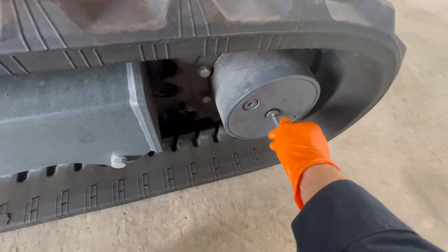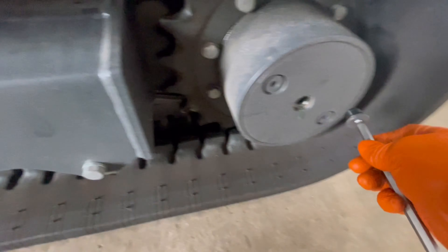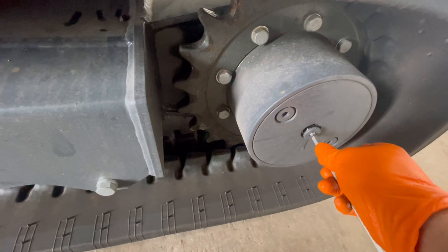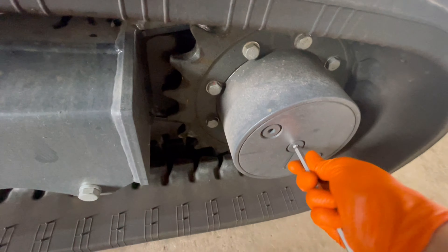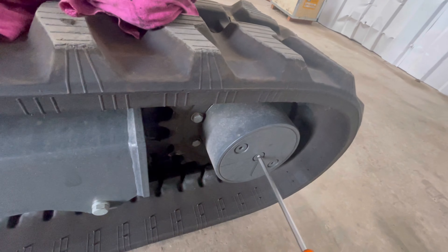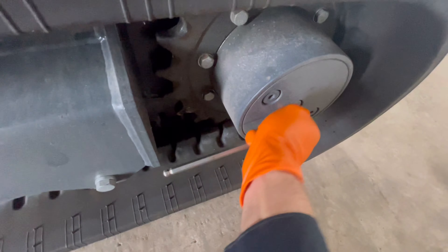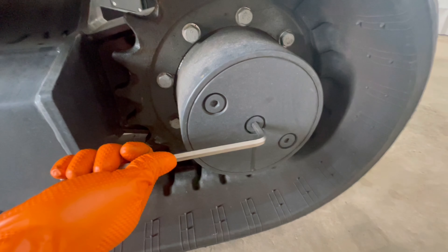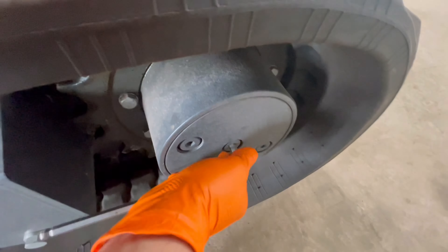That little job's done. I'll go and check that the pipes are made right and we'll check the final drive gearbox oils. Stand back because there'll probably be a bit of air pressure in here. Not bad - oil level is perfect. Again, it's one of those things - the one you don't check, they'll have no gearbox oil. It'll do 100 hours and the gearbox will fall apart. I like those hubs - it doesn't matter what position it's in, the middle is the level.